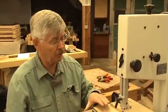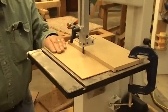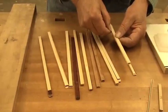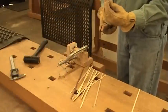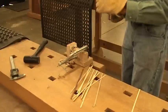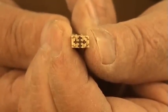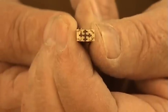To set up the bandsaw, first put a piece of thin material — in this case, a little composition board. Take a slice off of each of these, thin them on the veneer thinner, and then glue them together to form our log. As each of these strips gets a little thinner, you have to exercise just a little extra caution pulling them through so you don't break them. So that's what the pattern looks like in cross section.